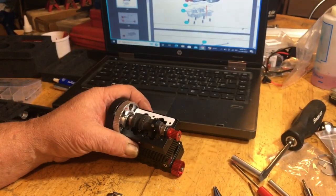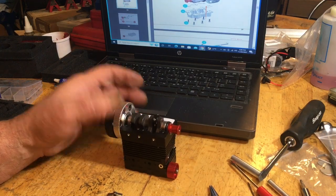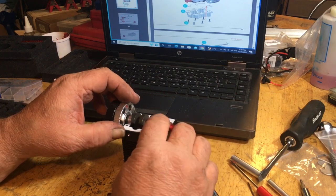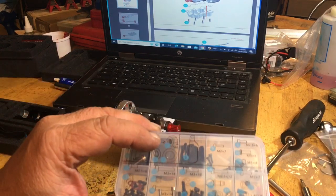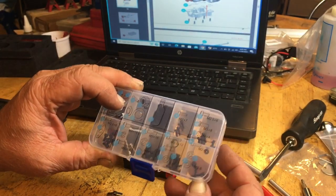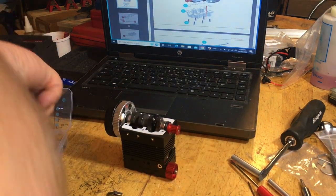Now, normally I would put a little silicone seal between the bearing and that, but I don't have any right now because I used it all up on my V8 engine. So, here we go. We're going to put that down. We got the seal down there. And we need 6 number 16s, which are in here. 6 number 16s, they're 3x10mm, and we'll put them in now, and we'll get the lower cover on this thing, because